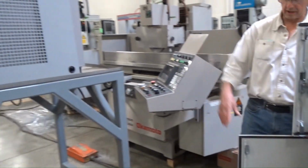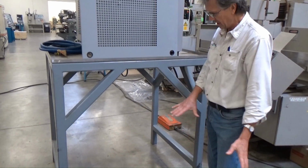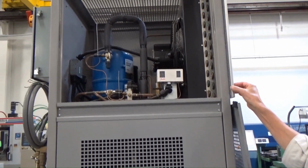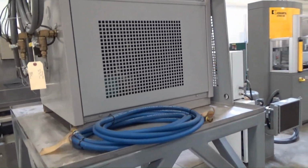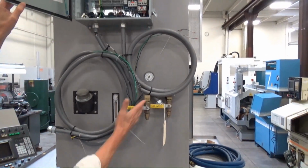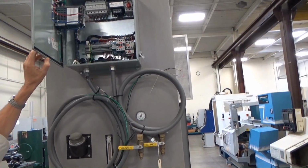And coming around, of course, you've got the chiller right behind you here on a stand, where the same hydraulic unit would just flush in right up here, and the panel would stop right here on the other side. It's just made to fit right up underneath here. So chiller, water chiller, hose is still laying here, compressor, we got the cover off up there, filter. This is all really nice here. Pretty clean, this thing's hardly run. And well, you said it had 500 hours. 500 hydraulic on hours, that's it, yep, you're right. And this would be the water level here. It's got its own standalone electrics. All you do is bring the 480 three-phase into it, and it's all standalone, self-controlled through the media temperature on the HMI screen, so that's all good.